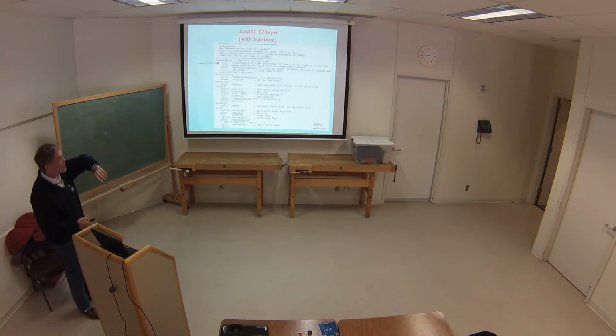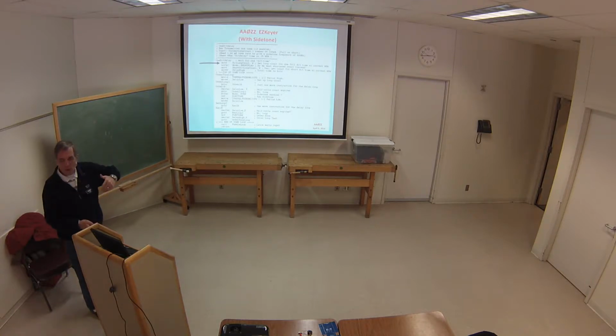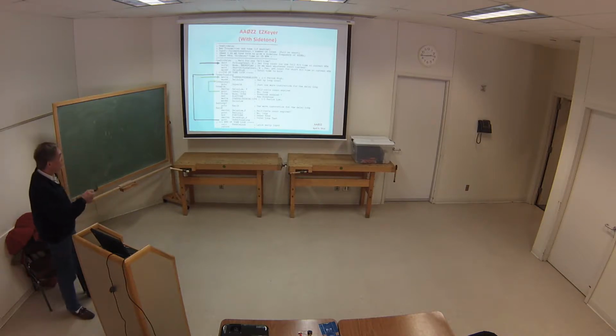Start out with a constant, where I know based on what speed you've got it set to. I'll change a constant in my code, and from then on I can use that, so I can pick it up in the code. I say, what speed are we running at? Oh, that's the number of loops I have to make a dit at that speed, or a dot at that speed. And then here's the basic loop that I'm doing for making one dit delay. This starts out with it unkeyed, and then the second half is keyed. So it looks backwards, but it works fine.